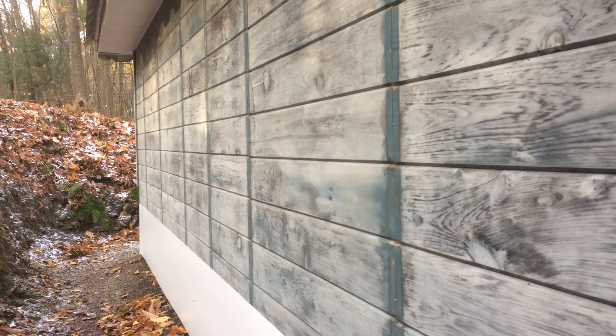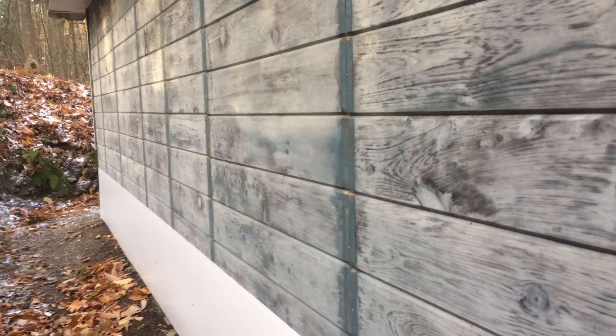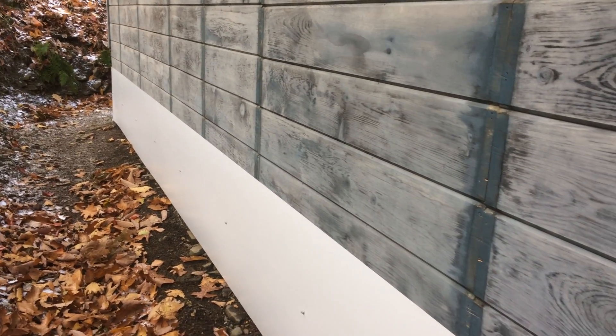holding the laser pointer and trying to get the nails in, but we got them in pretty close. We got the aluminum nice and even — you can see, no wrinkles, no ripples. We only put on the middle section because we're still going to put on a bottom flashing and then a top molding.